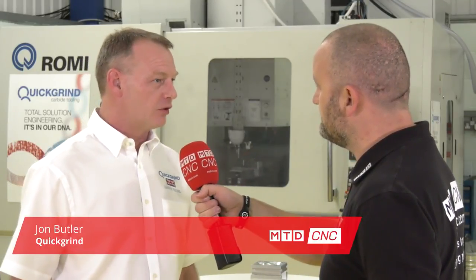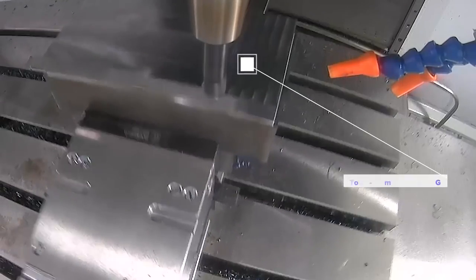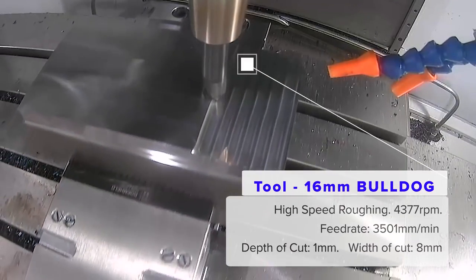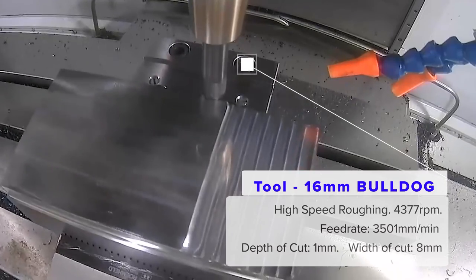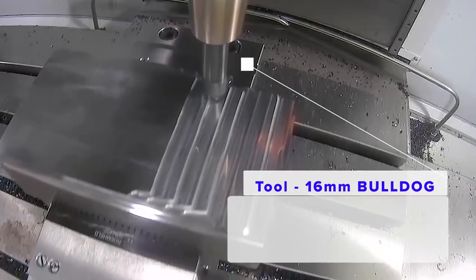So John, Mike told us all about the tooling you're using — but how about the strategy? Well, for the Bulldog show we're using a constant spiral down strategy on a contouring profile. It's a one millimetre step-down each time it moves around the part — it's very effective for the tool. The Bulldog is a bottom cutting tool only. It's a very high speed tool designed for cutting H13 soft and hard tool steel materials, with full re-manufacturing process available for the tool as well.